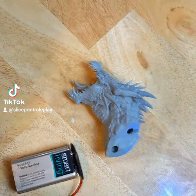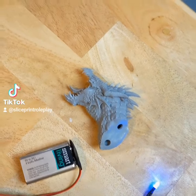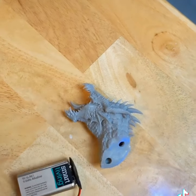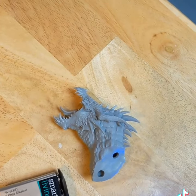What you want to do is with a model like this, you want to submerge it until the bubbles stop, meaning that it's filled up with cleaning solution, then turn it over so that all of that cleaner comes out and then submerge it again. I do that probably three or four times to make sure that you've gotten all of that resin inside flushed out.